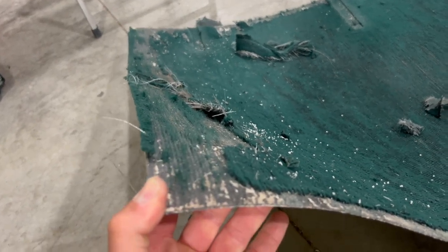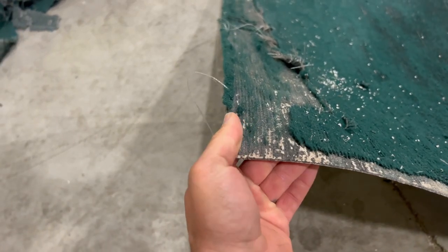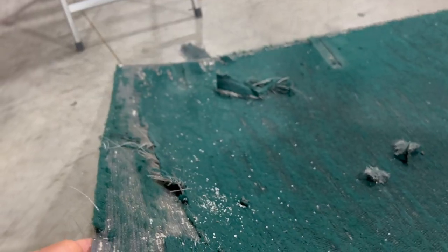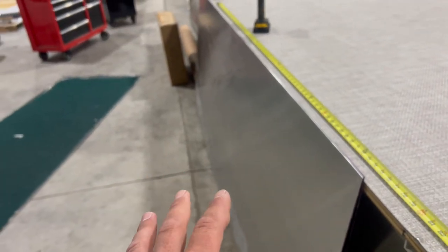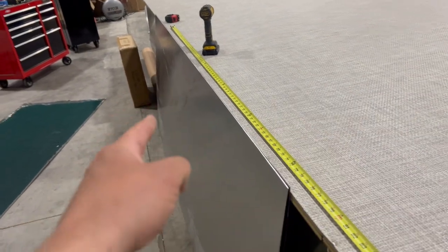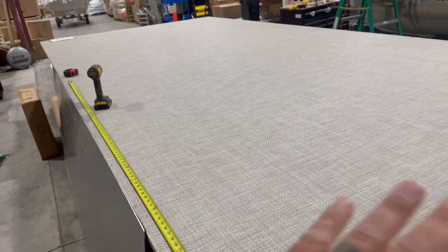If I were going to re-glue the carpet to this, I would have to get this carpet backing and glue completely off to where we have as clean a surface as this side. Not a super easy task, but I've got some aluminum sheeting that's the same thickness. I had some laying around and we just went and had it sheared to size. This is actually going to be sturdier, in my opinion, not add a whole lot of weight, and it's going to give us the chance to show you how we glue this same vinyl to aluminum, just like you would do on a Tracker or a Fisher or other boat that has an aluminum deck.